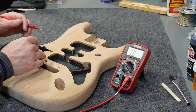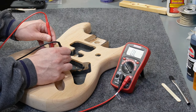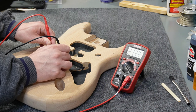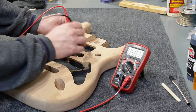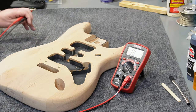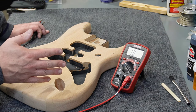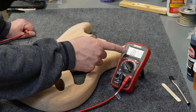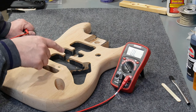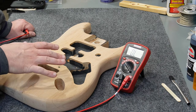I'm going to go with a solid part that looks like it's fully painted across and measure a couple inches apart with my two leads. That measures 27k or 27 kilohms. Let's do another one — 50 kilohms. Let's do one down here — 31 kilohms. So we're looking at on about a two-inch measurement that you'll get between 20 and 50 kilohms. The more ohms that show up on this meter the worse the connectivity is, or the more resistance there is, and the worse that is the worse your shielding is essentially.